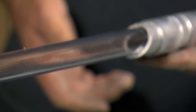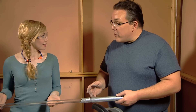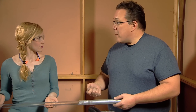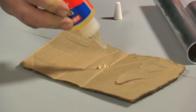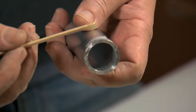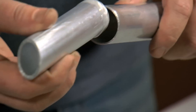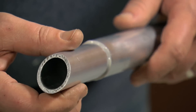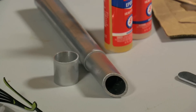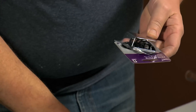So there's kind of the beginning of a lightsaber. What we want to do next is drill this out and tap it so we can put screws in it. One thing I want to do first is add some five-minute epoxy — that'll add strength all the way around, and the screw will make it secure. This is just a two-part, five-minute epoxy. I'm putting just a little bit on the bottom because when I put them together it's going to smear. While the epoxy is setting up, we'll start putting some O-rings on, then mix up more epoxy and glue the second ring on top. We'll do three.